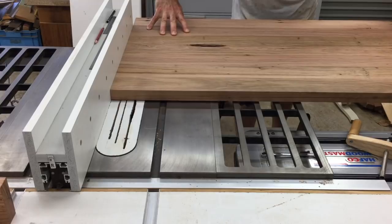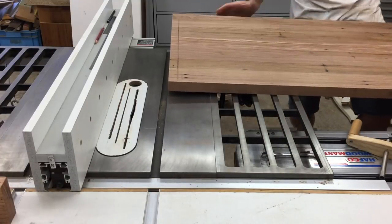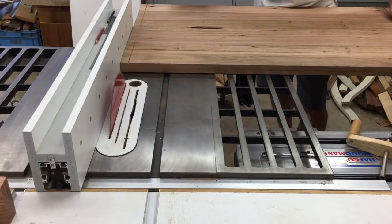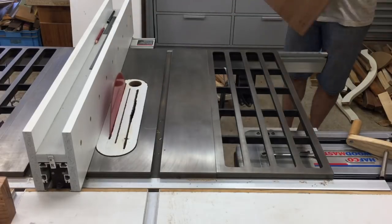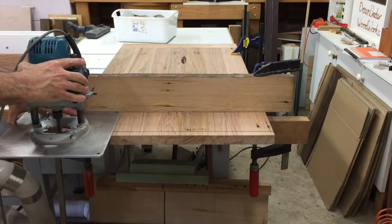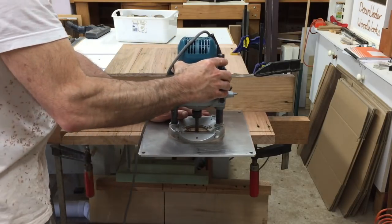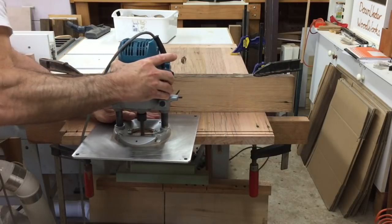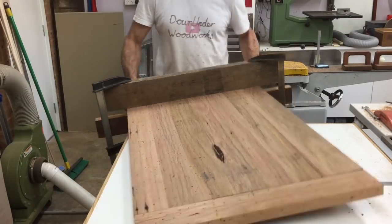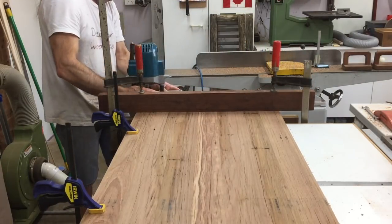Next I moved on to the tenons. To start I made a shallow cut using the table saw on both surfaces at both ends to eliminate any potential tear out if I had started shaping the tenons with the router alone. I then raised the blade to start the shoulder cuts at the end of each tenon. I clamped two temporary fences to the top and bottom of the workpiece to act as a guide for the router and to ensure that the top remained flat while cutting the tenons. Then it was just a process of making numerous shallow cuts equally on both surfaces to creep up on the final thickness and ensure the tenon was in the exact centre of the board.